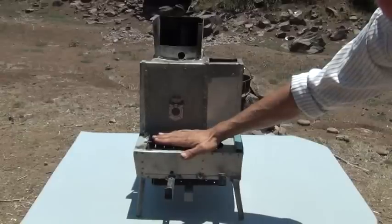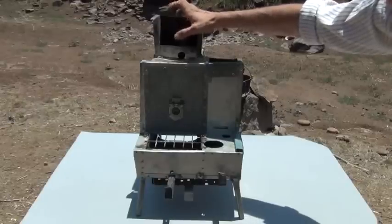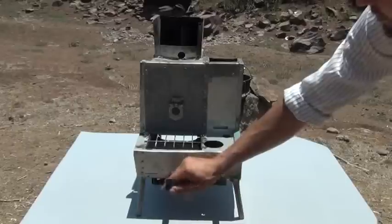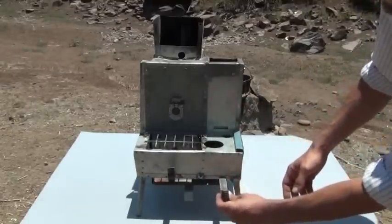That was one of the limitations especially for building a wood stove. So what I've done here is created a system that dumps from the bottom — dumps into a tray I'm moving with this arm here. That tray pulls out underneath your little grill with the biochar. So you've got basically a charcoal burn right underneath your grill. You can refill your gasifier, it'll burn nice and clean again and won't get locked up with the biochar. I have another lever here.